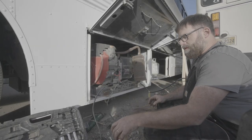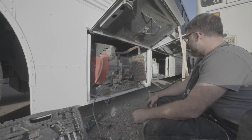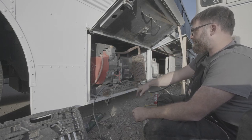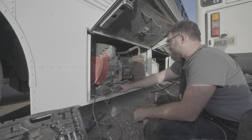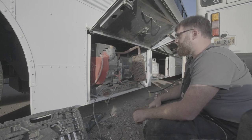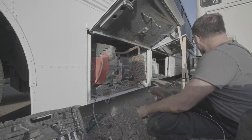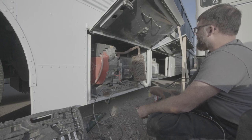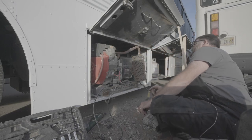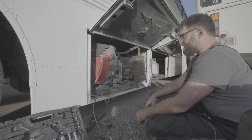All right Aaron, what are we about to do? We're about to burn your bus down. Don't put that karma out there. Anyway, we're just going to make sure this is off. We'll put some grease on the starter ring and cycle it around a little bit, so let's see if this goes. Now we're going to turn the propane on. All those breakers are off — that should be de-energized. This is hooked up to that. Our exhaust is over here so it's not touching anything, and we're going to see if it runs, then we're going to flip a breaker on and see if things are okay.